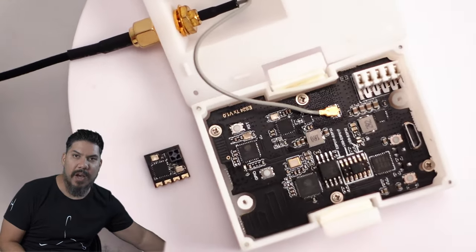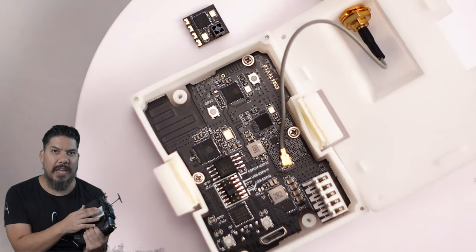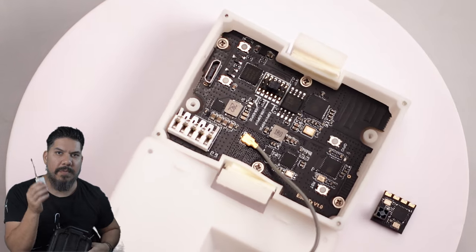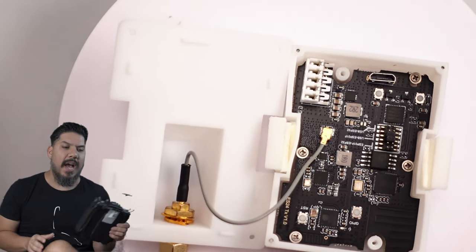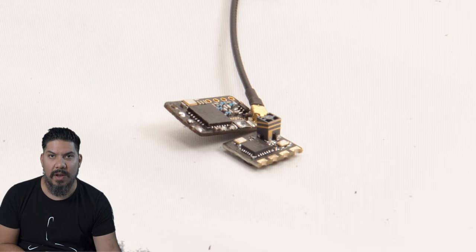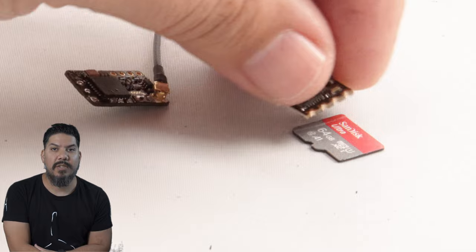The module is about $25 to $28, which is super cheap. The printed module bay and the injection-molded version both don't fit very well, so I used a little double-sided mounting tape to make the tab arm stick out better — that really helped keep it seated. It's not 100% solid but it never comes loose. The antenna on the module is smaller, and on the quad side these receivers are tiny, bringing the cost per quad from $30 down to $11.99 to $13, saving significantly on space and antenna mounting too.